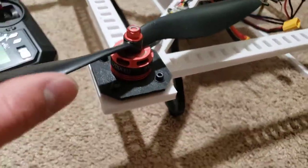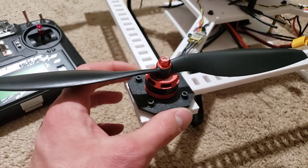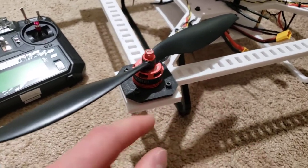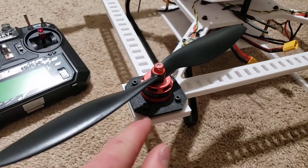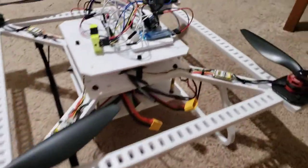The reason I have this separate plate right here is that the first couple of times I flew it, the motors got so hot that they actually melted the 3D printed PLA plastic. This plate is PETG, and the frame is ABS. PETG has a higher melting temperature, so it hasn't melted yet, but if it does, I'm able to replace that a lot easier than replacing the whole frame.